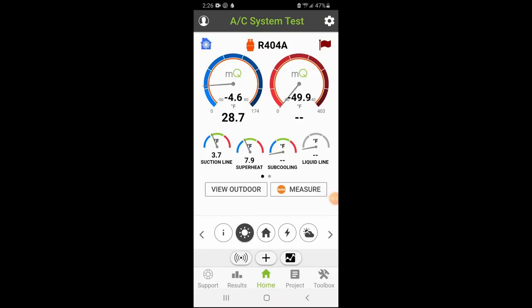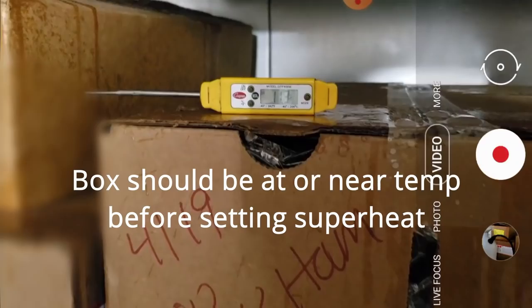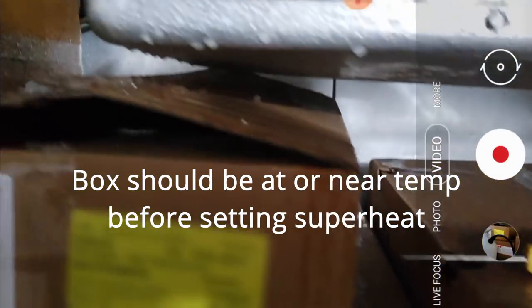All right, so basically we made some adjustments to the superheat for this freezer. It was running way up there in the high 20s, almost 30s area. Right now, as you see, we're running 7.2. It's fluctuating down to mid sixes, back up to 9. Our box temperature, now the head pressure obviously is not hooked up. We're running right around 11. Which we've been keeping the door open, so we got it all adjusted.